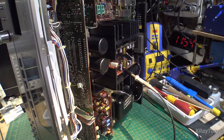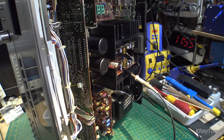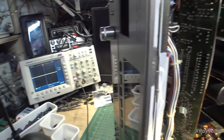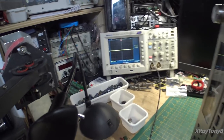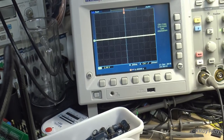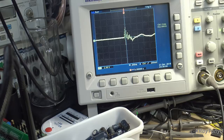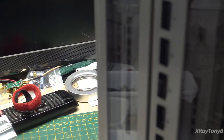We're all back together. I have the probe hooked up on the gate of the transistor that was oscillating, and we're back on the oscilloscope. Now for the moment of truth. Let's see what happens. All gone. And if we look at our power output meters, they aren't lit up anymore with no signal. Let's put it together and test it — I think we fixed our problem.